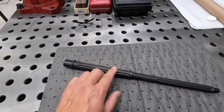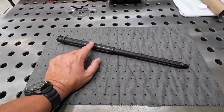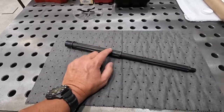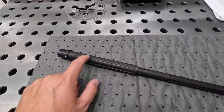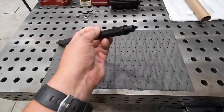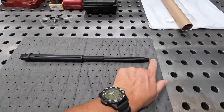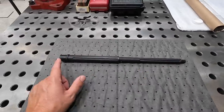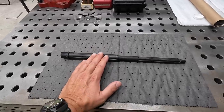Okay, so this component here, now this was made on a lathe that has live tooling, and what they were showing is that you can utilize that face driving system to index it, if you want to come in here and do like they did, they've got these flutes machined in here, okay? But just a really good example of taking apart and machining it from one end to the other in one operation. And you can turn multiple directions when you're machining parts using this,